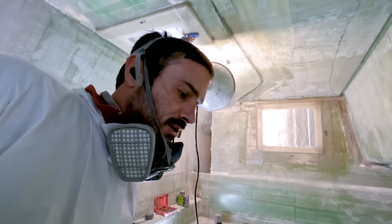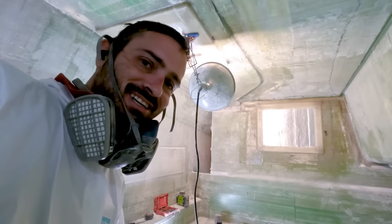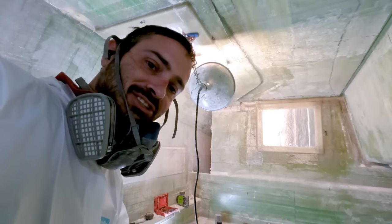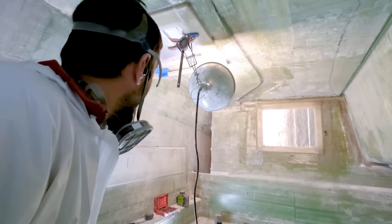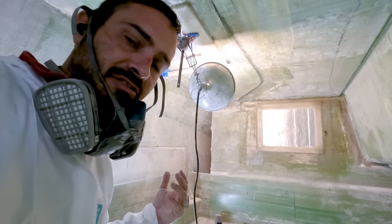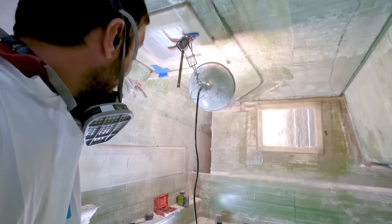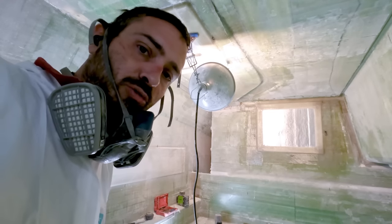It's lined up now. Had a bit of a setback with, of course, try fitting it, it's perfect, angle's all right. Once I put some thickened resin on it to hold it in place, it was no longer fitting plumb. So I manipulated it, got it in place, and it's all lined up. We're going to let the heat lamp go and let it cure. Then I can go through and sand back some of that filler that I put in, where the tape is, fill that area and then the upper area, and get the remainder prepped so that I can glass in a little bit and get that permanently in.